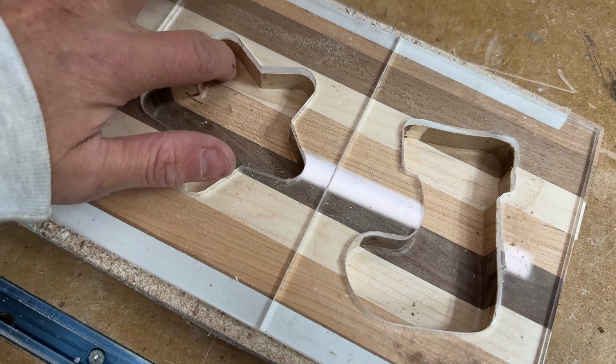To make the bottom, I added a straight edge to 2 pieces of offcuts. I used some painter's tape to hold these 2 pieces together. They are not yet glued together. I then placed my hexagon on top of this wood and traced the shape in the position as shown here, where the middle is being centered.